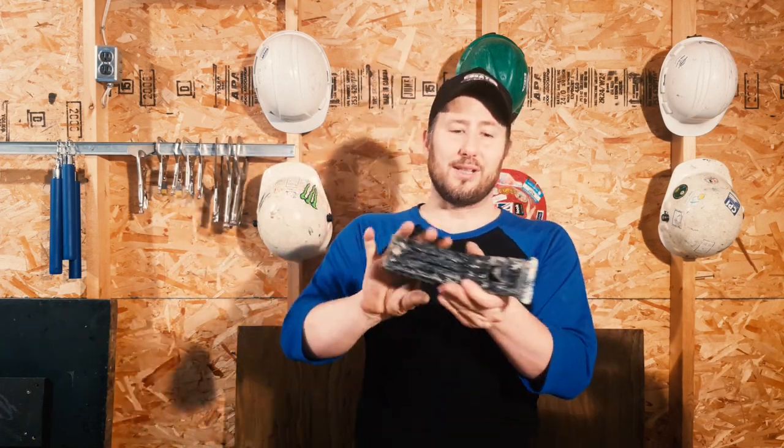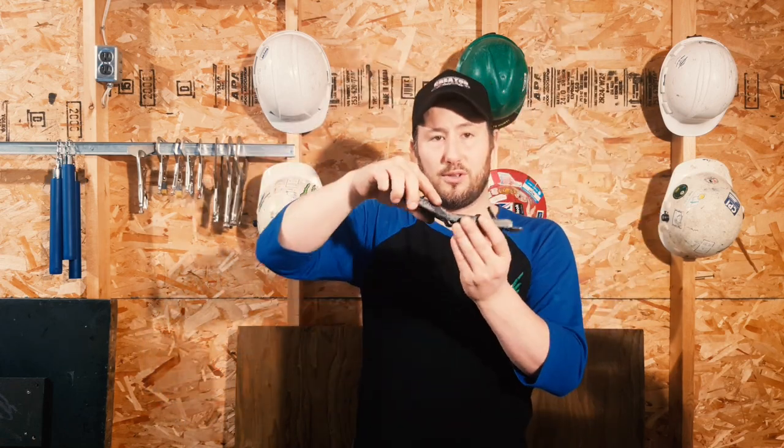This is your keyhole saw — your drywall saw — for manually cutting drywall. It's a simple tool just for quick cuts. Use your router for major cuts but the keyhole saw is for quick random cuts. This is your drywall rasp — it'll smooth the edges of the drywall when you cut and snap your board, making the edges nice and smooth. Make sure you have a rasp and rasp your joints. This is a drywall lifter — you'll use it to lift the drywall sheet tight to the ceiling when you drywall the ceiling first.